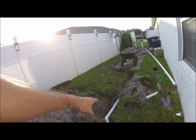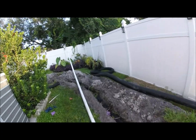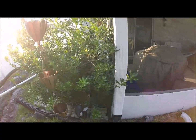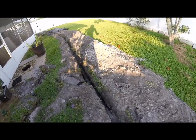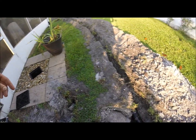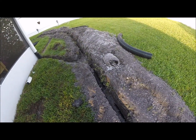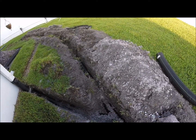From the basin it gets pumped out into this two-inch pipe out to the road. I've got all of the downspout gutters hooked together in this one main pipe. We've got a drain box over here that runs into it, and we've got this drain box running into it also, and we've got this downspout running into it.